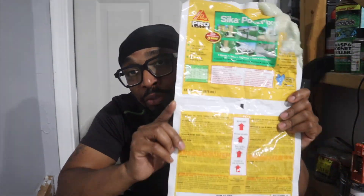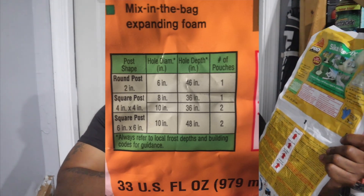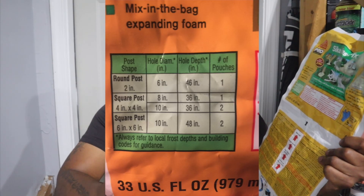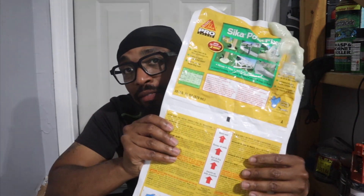I will be redoing the post. If y'all try this out, make sure you dig a good enough hole. I'd go with 8 inches in diameter and still test the two-foot depth, but get two bags — with one bag I'm getting too much shaking. If y'all have any questions, comments, or concerns, please put it in the comment section. I hope this video did you some justice — like, comment, share, subscribe, and I'll catch y'all in the next video.